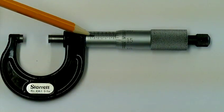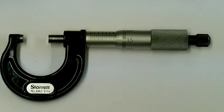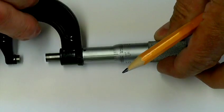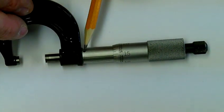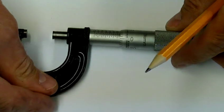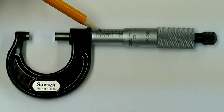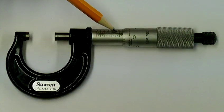This is called the sleeve of the micrometer and it's a friction fit onto the mic — the micrometer, also known as a mic. There's a small hole in the back of it where I can insert a wrench and actually move this collar or sleeve so I can set the size.